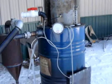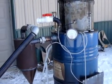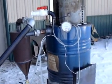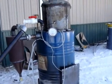You don't see a cooler in my system at all — that's basically because it's 5 degrees outside in the middle of winter and I'm not worried about needing to cool the gas down. It'll be plenty cool by the time it gets out the pipe, even though I suspect this particular gasifier might be good for about 250,000 to 300,000 BTUs an hour.